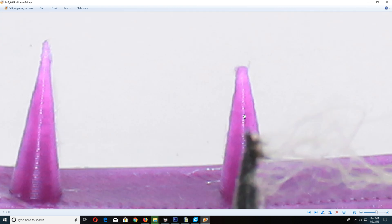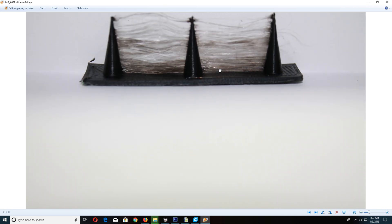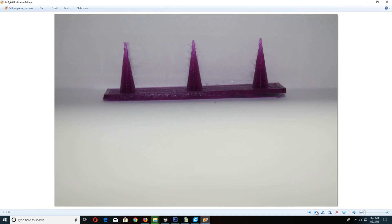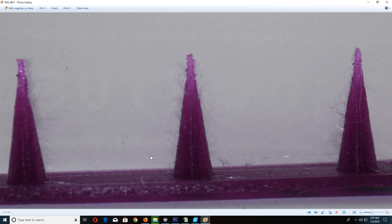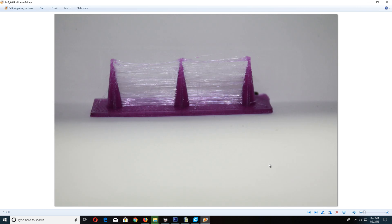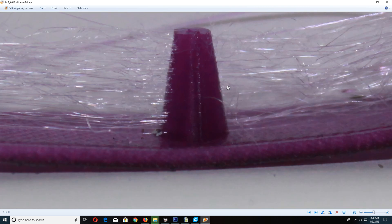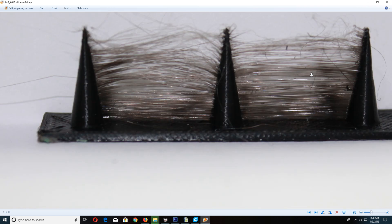This is the whole family together. The back one — you see a few little fibers, but there's no real stringing. This one with the default settings has a lot more. I changed all the settings except I kept the infill at 20, and it still gave me a lot of little hairs. This one is the default setting with a different PLA. And this one is what I mean by minimal stringing — not as much, but it starts bad at the base, so I canceled it.